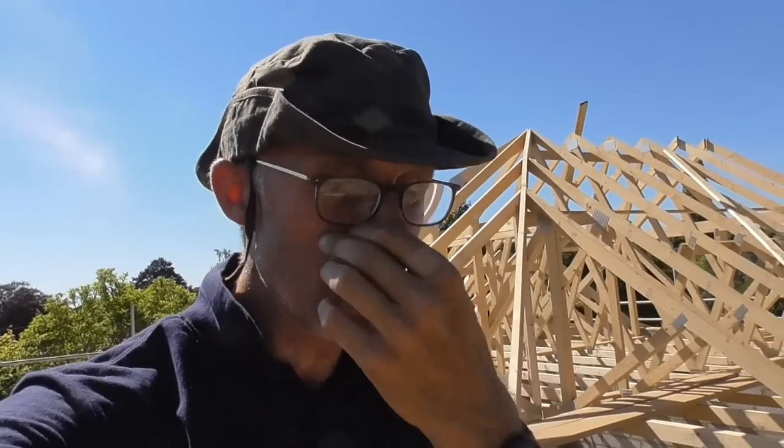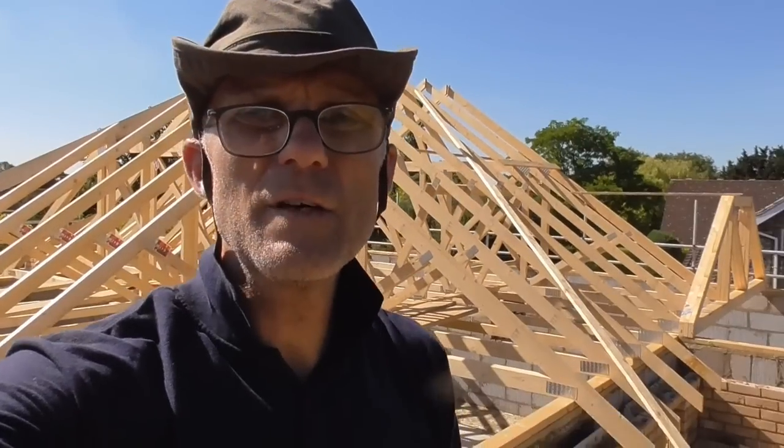So the flying top truss that I was nailing into it is twisted. The top of the mono that I was nailing into it was bowed, so I'm really fighting here. But once I've got a bit more of this infilled, all those monos are in now, and it's just infill, I might try and unpick that and straighten that up. Anyway, it's bakingly hot. It's 30 plus degrees already, and it's only 10 o'clock. So I'm going to have a sandwich, have some liquids, and then I shall start infilling these, and then move round to the other side.